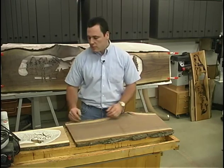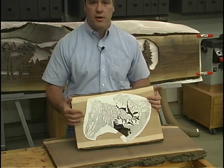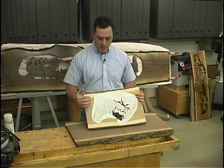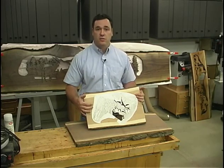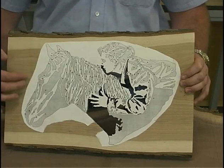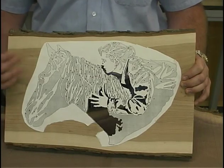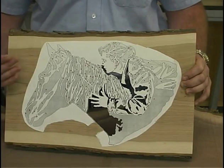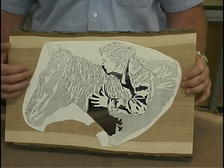Once the piece is prepared, on this design here there are a lot of different patterns available on the market — going to different websites, different scroll saw magazines. Be very open about what you would like to actually cut out. What I've done to prepare this is cut out the pattern roughly to the size of the slab itself. The next step is to spray the adhesive to the back side of the pattern. Spray the adhesive on just until the image starts to appear from the back side. Once the image has appeared, let the pattern sit to the side for about 20 seconds, then apply the pattern to your slab. The next step is to drill all your starter holes.